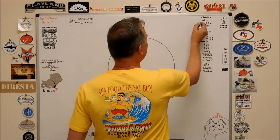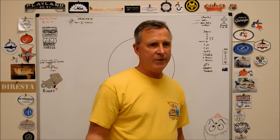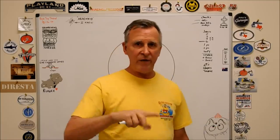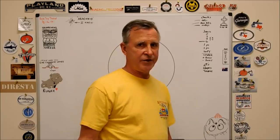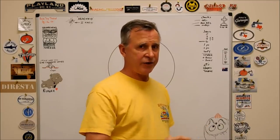All right, so you have the adjustable, non-adjustable, and independent. An independent jaw chuck would be a prime example of a four jaw, where each jaw has its own driving screw. Simple. My opinion, the ideal chuck to have is an adjustable body chuck, where once you torque down on it, you can then dial in the concentricity. Good.